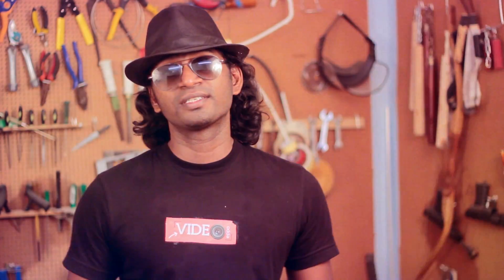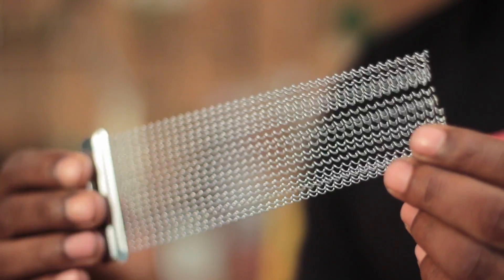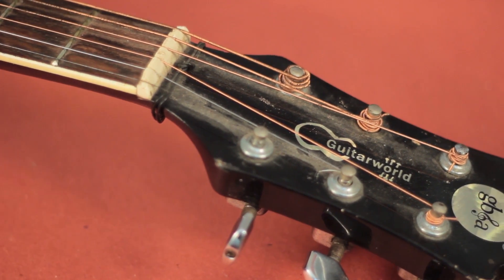Let me wrap up with the mistakes I made and what I learned in this process. Miter cuts with a jigsaw and without a proper blade guiding mechanism is a big no-no. Proper wood filling and making sure the surface is even is a must. A single snare spring is not sufficient — this depends on individual taste. I should have made this with 18mm plywood instead of 12mm plywood. I should have also left some option open for the guitar string type setup as well.